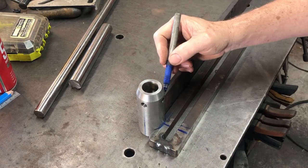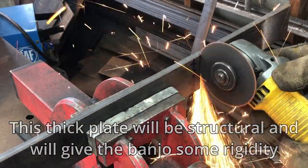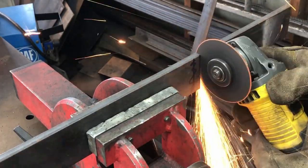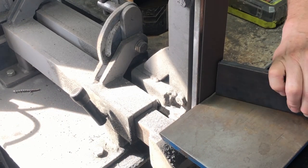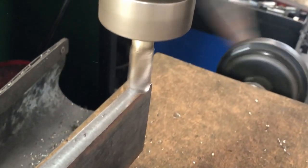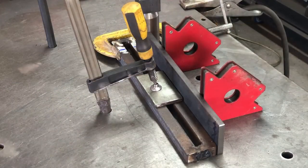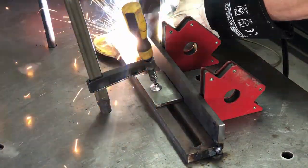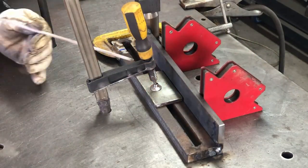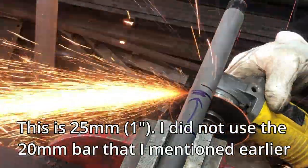Now I'm looking at working on the bit for the back — the 10mm flat plate. That gets cut off with the grinder, then over to the belt grinder to put an angle on it so that it fits around the round stock. I want to work with flat surfaces so I'm over on the mill cleaning that up. Now I've got everything squared up and clamped down on the bench and I tack and then weld all these parts together. Then I start working on the eccentric bar that goes right down the centre.